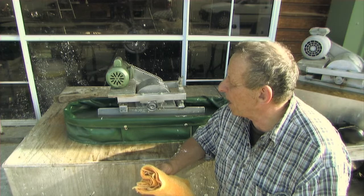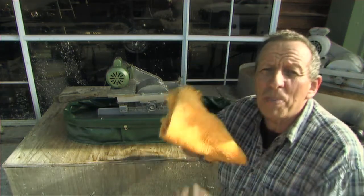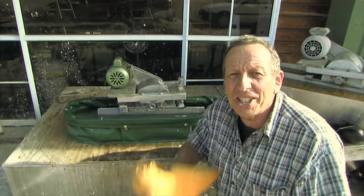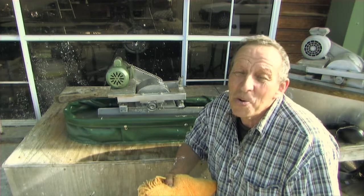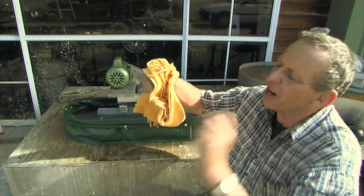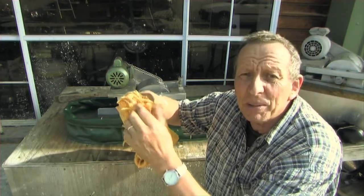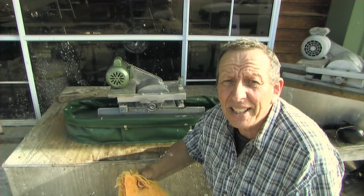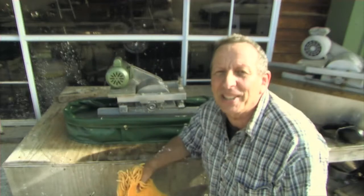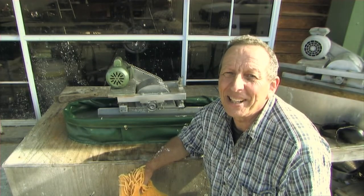So I forgot to mention, make sure that what you're pulping up is actually cotton, because there's a lot of polycottons out there and they don't make paper. So the way you test it is that you strike a match and burn a little bit, and if it burns cleanly with nice clean ash, it's cotton. But if it all beads up and smokes with black smoke, it's polycotton. Don't use it for making paper.